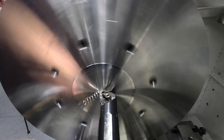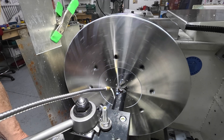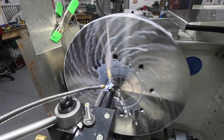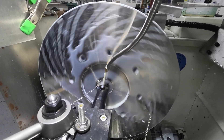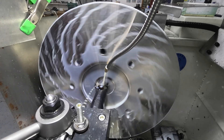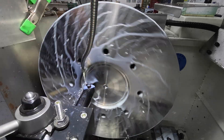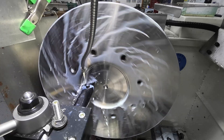On to the final stage for this side of the part — just machining out the counter bore, nothing too complicated. Start the counter bore by drilling out a hole in the middle and then working outwards with a boring bar to final dimension. Because this was now approximately 6 inch diameter it's more within the normal working range of what I do on this machine. The only difficulty was using extended reach with the boring bar to get across the gap, which again gave a more flexible setup than I would have liked and would have warranted a custom made tool to increase rigidity.